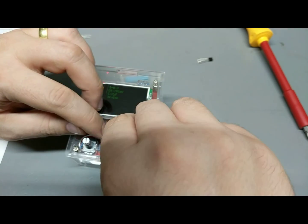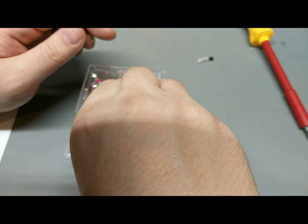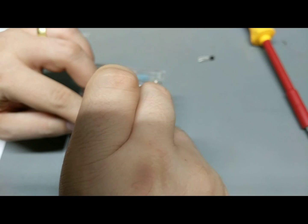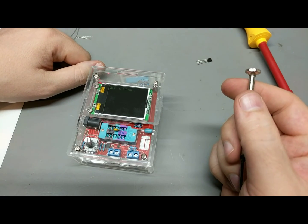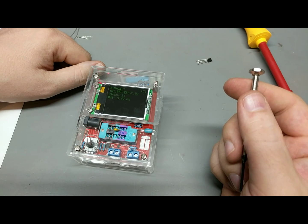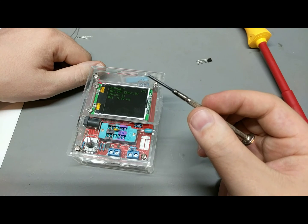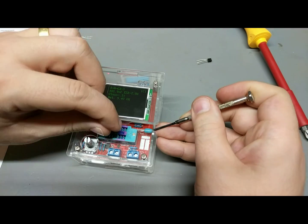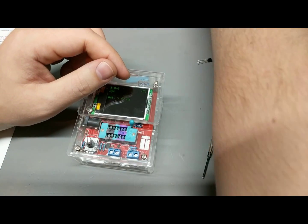Let's try this 100 nanofarad cap out of the kit that was left over. Let's just jam it in. Yeah, this is not going to work. I'm going to need to modify this case. Initial button to test. So it does say 100 nanofarad, 2.8 ohm ESR. It's kind of surprising. Yes, well, that's okay. Let's try something big.